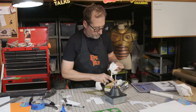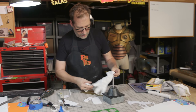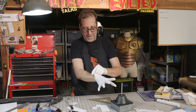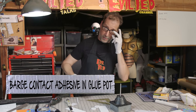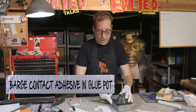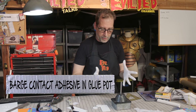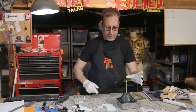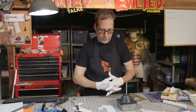While working with glue, be sure to put your gloves on. I used to pour contact cement from a can into a metal can with a brush and it would just dry out on me. A glue pot is universally great because it has a vapor lock — once you close it, it puts a lid on it and keeps the glue from drying out.